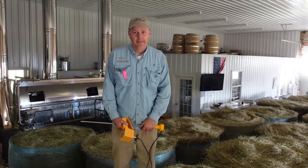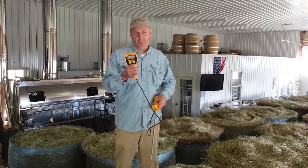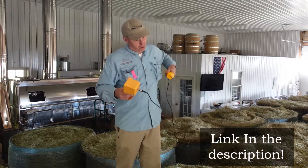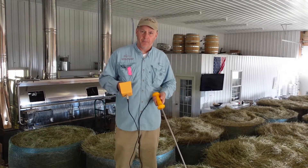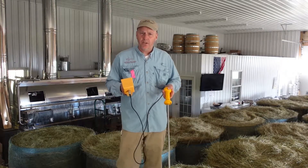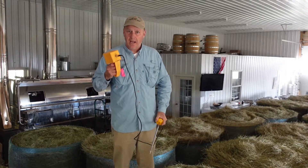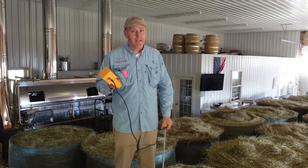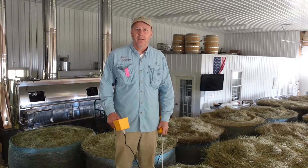That's not anything we can afford at this point. We purchased a Draminski moisture meter and temperature probe — this thing is stout. You just shove it right into the bale and it'll tell you either the moisture or the temperature; you can toggle between the two. Any bale that is either high temperature — over a hundred degrees — or high moisture — over fifteen percent — we're going to mark it and leave it out a little bit longer.